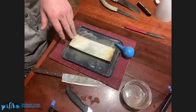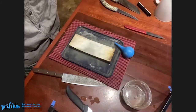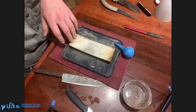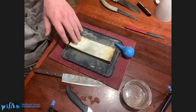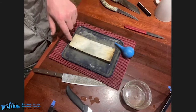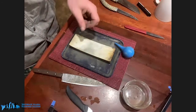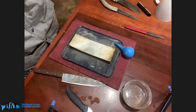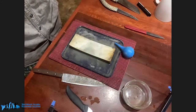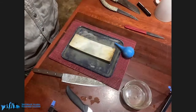by hand on a whetstone. The other issue that I have with stainless steel knives when you use them on a whetstone is you tend to get more of those burrs, right? The fine hair-like strings of metal coming off of your knife, off the blade. So you have to do more stone maintenance as well.